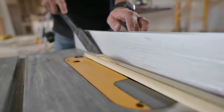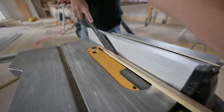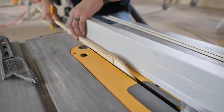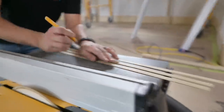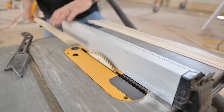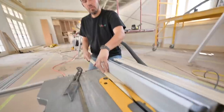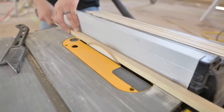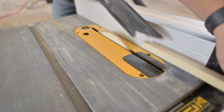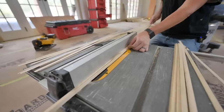The whole process is ripping these things into little individual strips — one-sixteenth to an eighth of an inch — and just repeating that process until you have the full profile. It goes without saying that you're going to lose material to the thickness of the saw blade, turning it into sawdust, so you need more than enough material. I labeled the strips because there were so many — I ripped one complete profile and labeled them one through five, then the next alphabetically A through E. It actually took four full pieces of molding to get this done — four times as much as a single board.